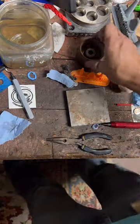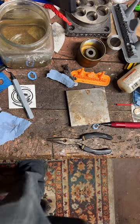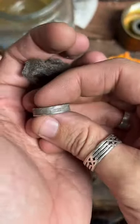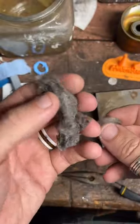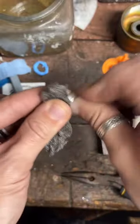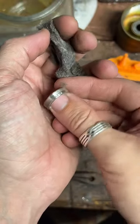Now this is my favorite part. This is where we take the coin ring and make it shiny again. We're going to get our little scrap of steel wool. What's on the coin right now is called fire scale — when we heat this up with the torch it leaves this dark toning, and we're just going to knock that off. This is super fine steel wool — 4-0 steel wool. You don't want to get basic normal steel wool — it'll leave scratches all over your rings. Make sure to get 4-0. Look at how quick that starts to shine back up the silver — it's amazing.